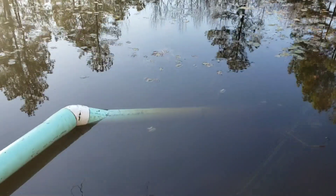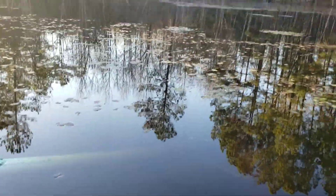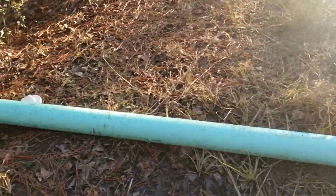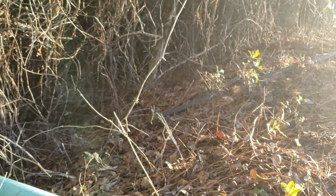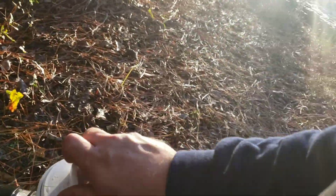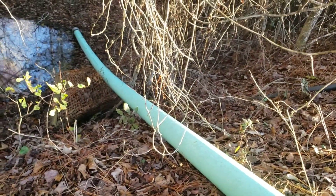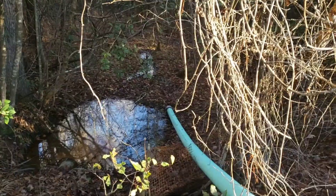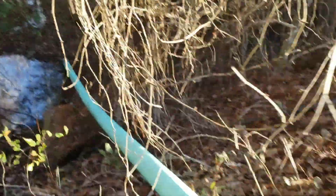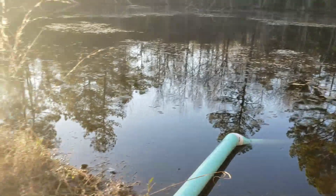Quick recap: got a 45-degree fitting connecting one single piece of four-inch PVC going down to the pond, got another piece connected to my tee, with the water level filled up to the tee at the top of the bank. At this point any excess water just runs back into the pond. Down at the bottom of the hill I got two pieces of PVC connected to get me all the way down. Cut the plastic bag they have duct-taped on the end — the water flowing out creates suction to get the siphon going, and it'll just keep draining gravity-fed until the water level drops low enough for it to cut off.